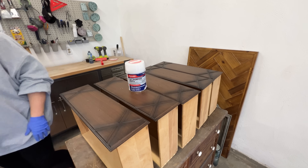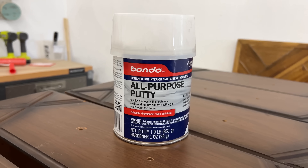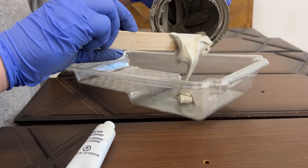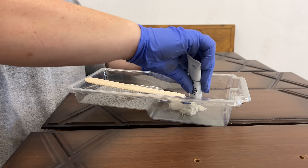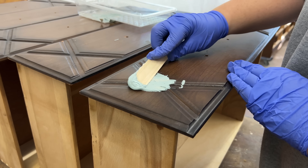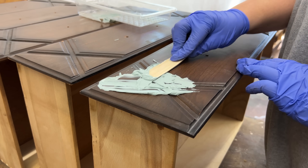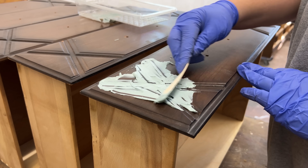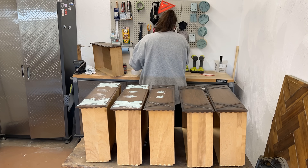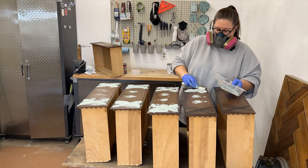I needed to fill in these X's on the drawer fronts to get them smooth or flush enough to be able to use the texture roller that I wanted to, and I decided to do all of this filling with some all-purpose Bondo. Bondo is a two-part epoxy style filler that needs the base putty to be mixed with a separate hardening agent that creates a chemical reaction and causes it to harden to a really strong state. It can then be sanded or even drilled or screwed into just like wood. It does start to harden up really quickly once it's mixed, which means you only have a few minutes to manipulate it, so I started mixing it up in small batches and smearing it into those recesses. It would be pretty impossible to get these filled all the way flush in one shot, so I got them filled as well as I could and once this round is set I'll do another layer over top to fill in any shallow spots.